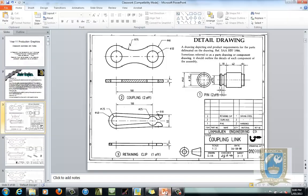If we go back to our drawing, I said the last thing to do is to put in this radius of 75. So what we'll do, we'll draw ourselves a circle with a diameter of 150, because Creo works on diameter, and then we'll tangent that circle to the edge of this one and to the edge of this one here.